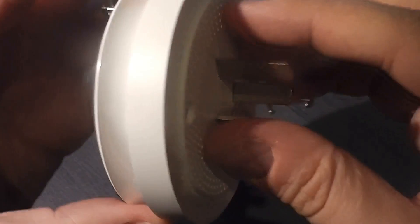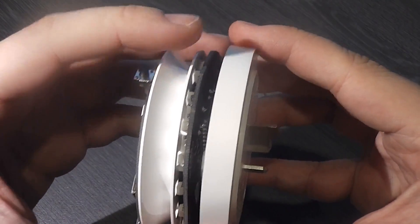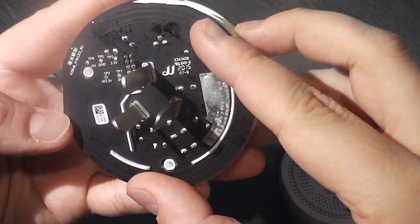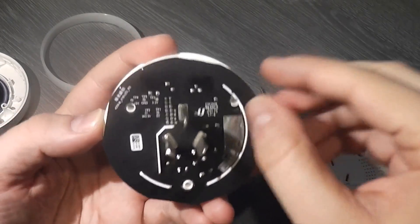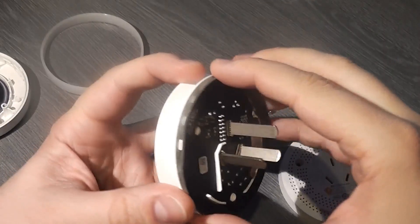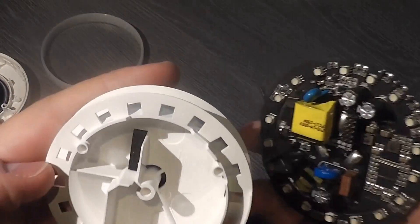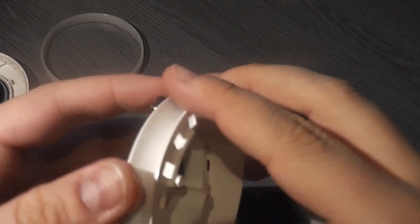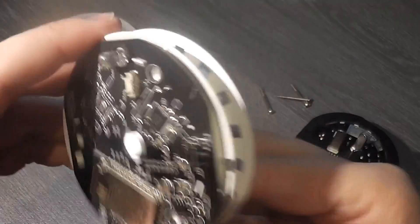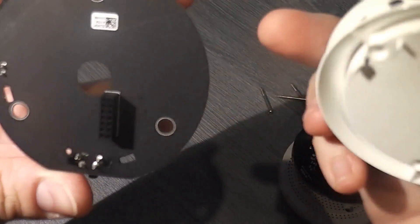Let's go one level deeper. It's pretty simple — it goes straight through. So we've got two PCBs. This one has the pins directly soldered in, and it's got grooves for isolation, so this must be the high voltage section in the middle with all of the LEDs around the edge. Separating the two boards — there's a nice header that comes together. Not much on the back there, just the header.